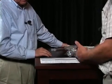And you can choose what allergen type you want tested: dust mite, fungal package, cockroach, cat, dog. There are a lot of concerns about cat. Unlike mold, some of these allergens have actual threshold limits, so those are important. Allergens are becoming more and more important for people as they become aware of them, and people are starting to test their homes, especially when they buy new homes. They test for allergens to see if the family had a rodent problem, a cockroach problem, if they have amplified dust mites, or if they have cats or had cats. So that's the way to test for that.